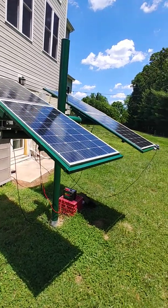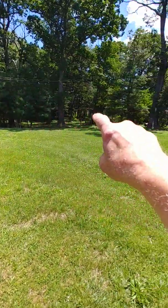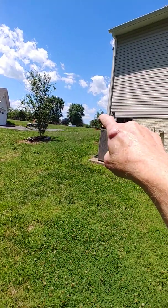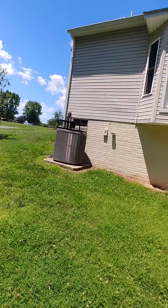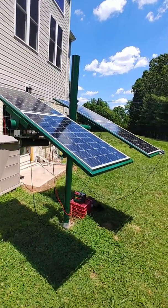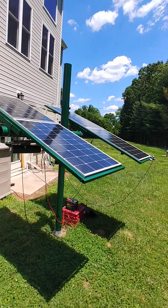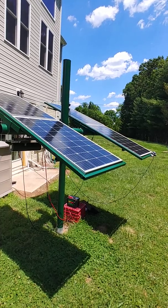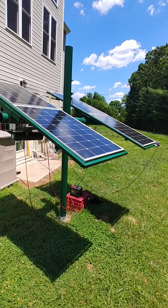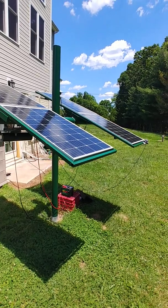What's really funny is it goes left to right — east is over there. So it'll go from there all the way around about 220 degrees to the northwest. At night time, when it's facing west after sundown, after a 30-minute delay, it'll turn around and face back east waiting for the morning sun, which is really quite cool. And it goes crazy when the sun goes out — on a cloudy day it'll start hunting all over the place and align itself with the brightest cloud.